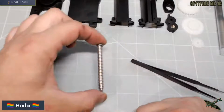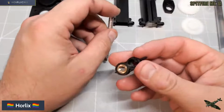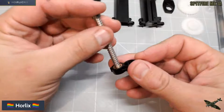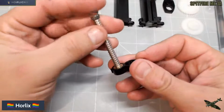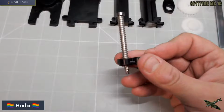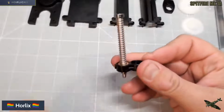We've got step 2 then. Fit the threaded rod 8112 into the brass nut in the base for the rods, 8106. Note this end of the steel rod has a longer shaft with a flattened side. Okay, yeah, that's the one. It doesn't say how far to screw it in. I just did mine a couple of threads. Yeah. Okay.